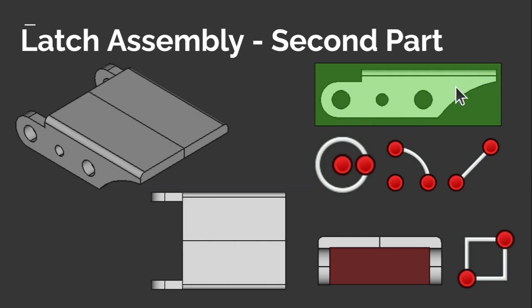With this profile, we can see we can just sketch this shape. If we pad that, then we just need to remove this space. So this is negative space. So we're looking at one single sketch here, followed by a pad, and then creating this sketch within here, removing that material. We've just done the bulk of our modeling in two operations. Because we've got less operations in there, we have a more stable model.